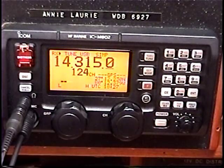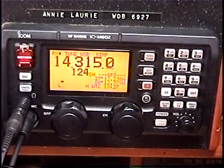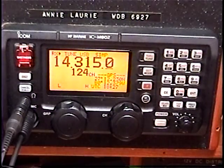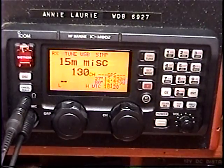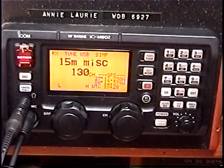I'm going to switch the refrigeration unit off — it should be very evident to you when I switch it off. Some of the sources of onboard interference could be inverters, battery chargers, particularly little plug-in-the-wall chargers for cell phones or battery-powered drills and other little accessories — they're notorious for creating all sorts of RF problems onboard. Digital clocks, digital panel meters, anything with a microprocessor or a switching power supply in it — notorious for causing lots of interference.